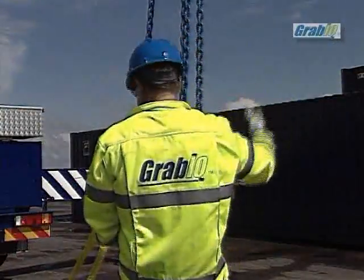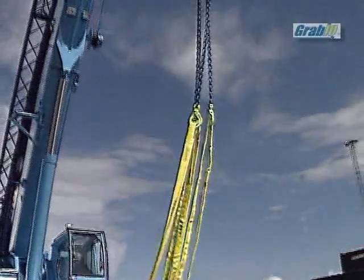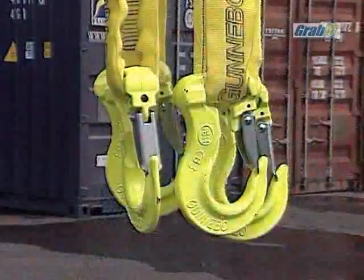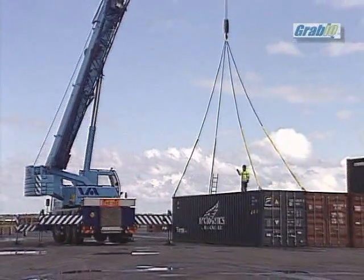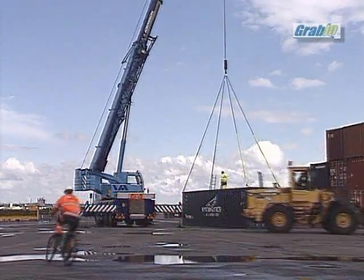The main sling here is a four-legged main sling that is common within the construction and harbour industry. You start from the main sling and use combinations from that one, as in this case with three-ton polyester slings and RH hooks. We would like to point out that lifting from the upper container points is only allowed with an empty container.